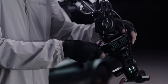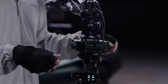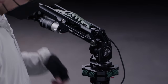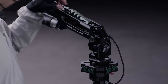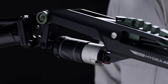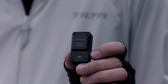We're now going to look at how to balance the shock absorbing arm. The goal is to adjust the dampening so that when you release the gimbal, it quickly returns to center. You can adjust the vertical or tilt dampening by adjusting the small dial on top of the arm. Please note this comes preset for a 5kg payload, meaning in most cases it will not need to be adjusted. For better control of your gimbal while on a moving vehicle, we recommend using the DJI external GPS module.